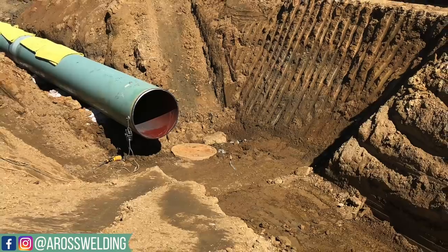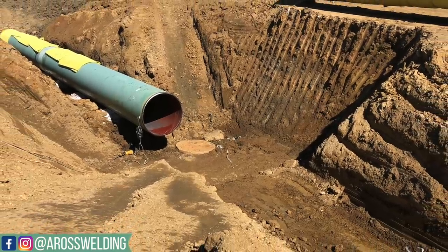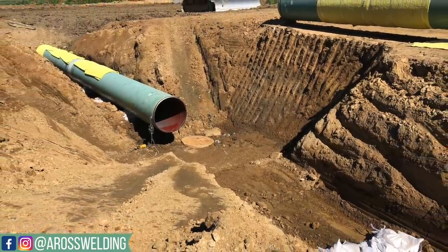Bell hole, not to be confused with Arkansas bell hole. The bell hole is just a bigger, more laid-back area in the ditch — just for guys to work down in the ditch safely. A lot of your ditch is going to be more straight up and down depending on the terrain. On tie-ins, whenever you're making a weld in the ditch, it's so you have room to work down there and it's safer. A bell hole usually has two ramps, one on either side of the pipe. It's for safety more than anything, and so you have room to work — not only for welders, but for inspectors and the x-ray crew that have to shoot that weld and get all the way around the pipe.